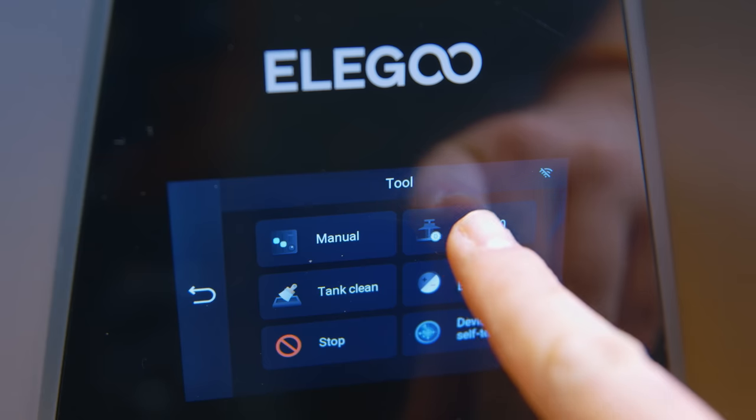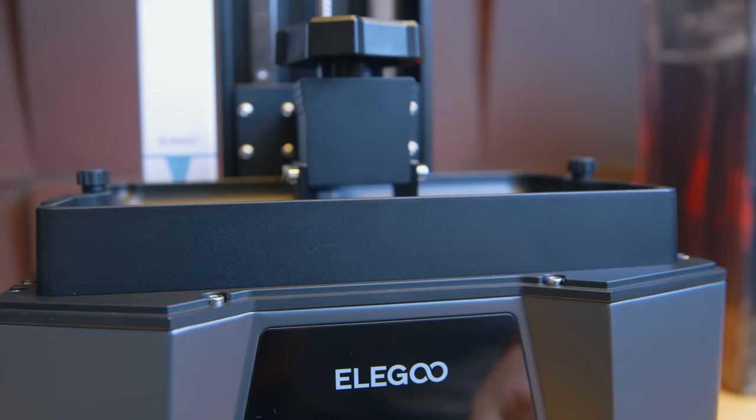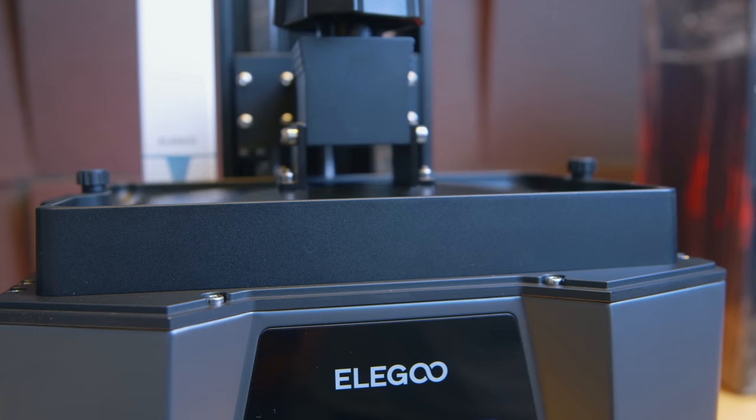Don't fully tighten around the bolts in a circle or it may shift out of alignment. If you do this right, you'll only ever need to do it once. And if this is your first time, before you move on, make sure you tell the printer that this is the new zero position. It's easy on the Anycubic because it's on the same screen, but on the Elegoos, for some unintuitive reason, you must back out of the menu and choose Z equals zero. I've seen many comments from people saying they can't get the base layers to stick, and they've usually missed this step.